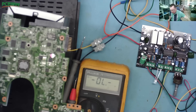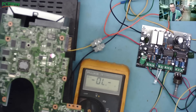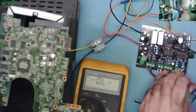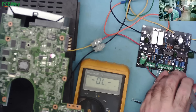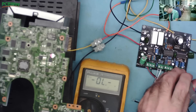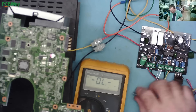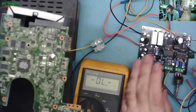Here's a 1 microfarad 50-volt electrolytic — that will fit nicely. Let's make sure it doesn't read short — no, it doesn't, good news. Checking with the capacitance meter — reads 1, so it's fine. We need to determine which end is ground to get the polarity right. One end goes to ground, which will be the negative end of the capacitor. Let's put it in and see if the circuit works.